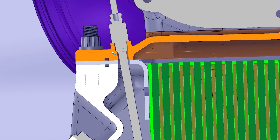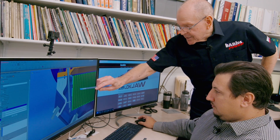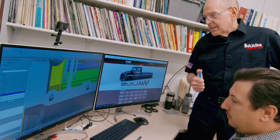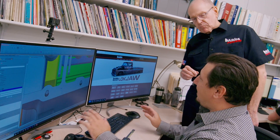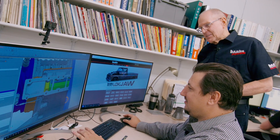We're going to come in and indicate in, then machine that for our nozzles to penetrate through. We're not going to touch the lower manifold, but the upper manifold will have the boss, the threading, and we'll pop through there. Right here is one of those clearance bosses. At about this elevation, I'd be spraying laterally off each side of the nozzle. If we spray laterally this way and that way, you have to clock them. Is this one going to impinge on that? That's what I was worried about — it certainly will to some small extent, but I don't know that it'll be a huge problem. It depends on how it dispels, what the plume looks like. The problem is clocking the nozzle — it's pipe thread, and it's always a bear when you're trying to clock pipe thread. You can see our thermocouple popping through right there.